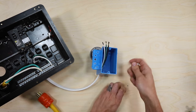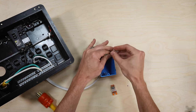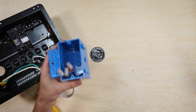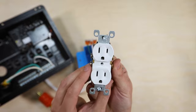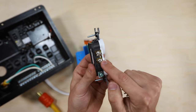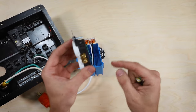We're going to be using lever nuts to make these connections, same as we have in the last half dozen videos or so. Now that we have our lever nuts on the ends of these wires, we can start making the actual connection to the outlet. The ground wire goes on the green screw, the neutral wire goes onto the silver screw, and then the hot wire goes to gold. I think of silver as white — that's how I remember it.